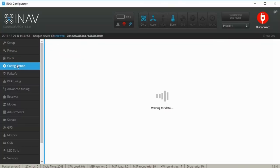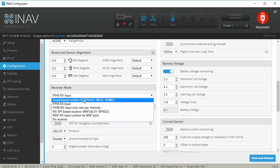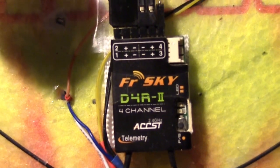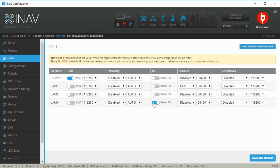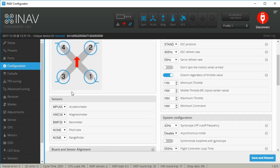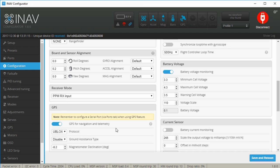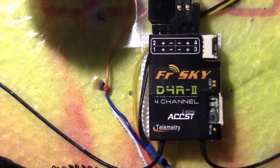The rest of the configuration is the same as usual for setting up SBUS. But I just decided not to use it — instead I used the D4R2 in PPM mode. Like some other boards, this port is both PPM and SBUS; it just makes a difference how you configure it in CleanFlight. The SBUS and PPM is inverted, which is good news for receivers like this one because you don't have to do any workarounds — they just plug right in and work fine.